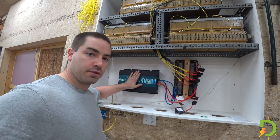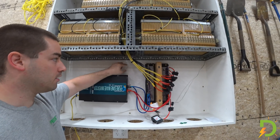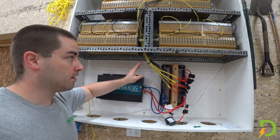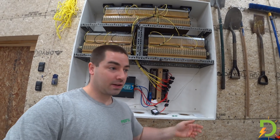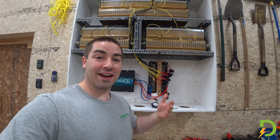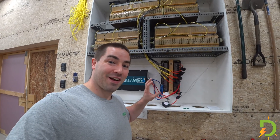The other option: I could move the inverter a little bit, and right up in this location I could put in a DIN rail with a series of circuit breakers. I could have eight circuit breakers for the eight positive leads before they go over to the bus bar. If it trips, I just reset it — it's simple. It doesn't cost me again to buy more fuses. So there are some positive parts to that DIN rail circuit breaker idea.